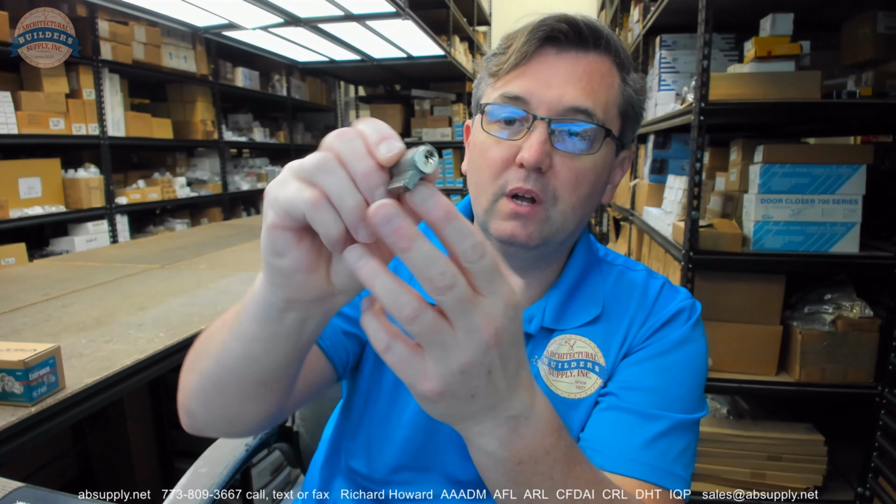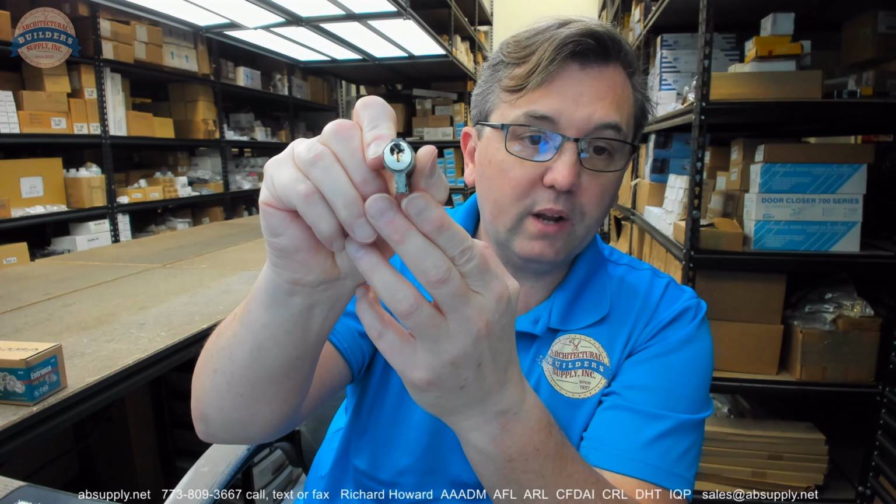So the way that we do it here is springs are towards the top. In Europe and other places where they use profile cylinders, they kind of look like a keyhole, like a skeleton keyhole is what the profile of a profile cylinder, or a Euro cylinder, looks like. They don't see a problem with that sort of design, and I think they write off the commentary about the springs fatiguing completely. However, I've repinned Euro cylinders, and I thought, well, the key doesn't work. The key works intermittently at best. It does not work every single time. And I discovered, well, it works really great when the springs are up here, not so much here, because those pins are hanging down.